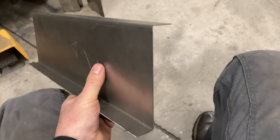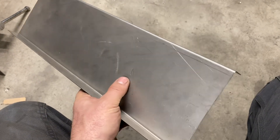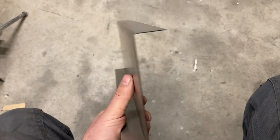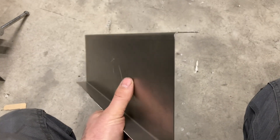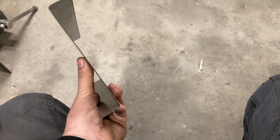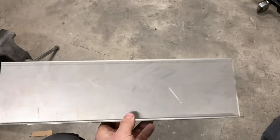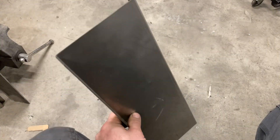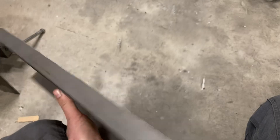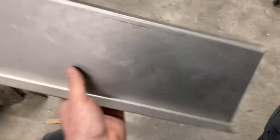Like so many things, the most important work is in the prep. In this case, the prep was the layout — making sure that the backstops are set correctly. Spending that extra time probably took me 10 minutes to do that drawing and get those dimensions figured out. Especially in a case like this where I have one piece of material to get the correct part — if I'd just winged it and goofed this up, I'd be running to the steel supply place to buy a piece of sheet metal I don't even need, or pay to have this exact size sheared.